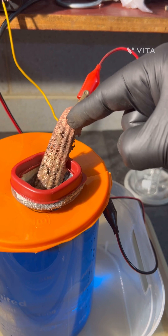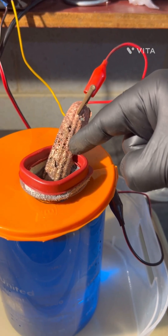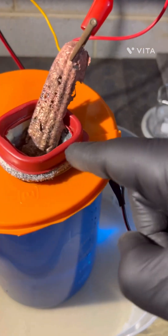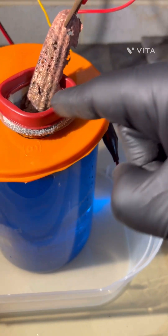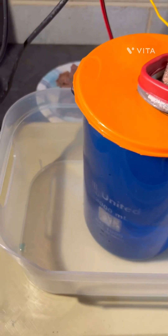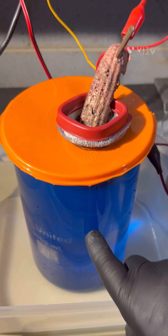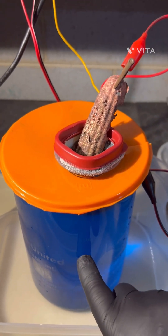When I put copper with my copper pile and cement out with iron, I get some copper, and what I was trying to do is recover some of the precious metal and silver in the slimes. I went cheap — this is just a sock and I hope it'll stand up. I had to add a little bit of sulfuric acid to increase the efficiency and conductivity of this solution.